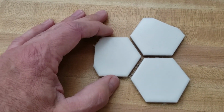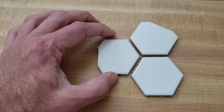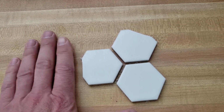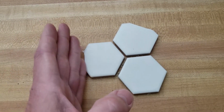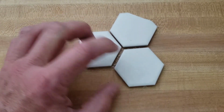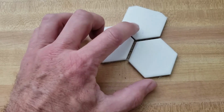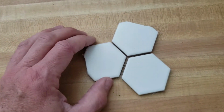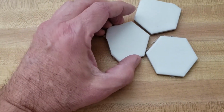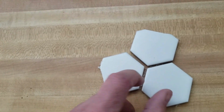Here I have 3 separate tiles to illustrate something I discovered while I was putting down whole sheets of tile. During my dry run, where I was cutting sheets out and fitting them together to see how it would work and get the little edge pieces cut where they would meet the wall, I was worried because I ended up with whole sheets that were penned in on both sides, and where I wasn't able to maintain a nice gap between the tiles. And I was afraid that whole sheets would go in and be too close and have gaps that were too small. But it turns out that when you put in a sheet, the netting that connects them underneath is flexible.